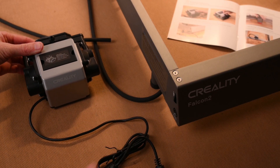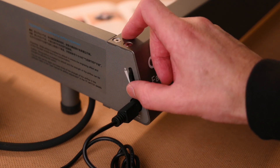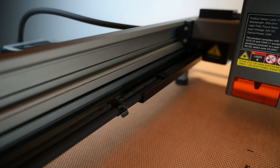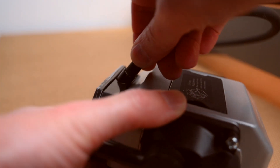The air pump can be placed next to the laser and a single cable plugs into the side of the frame for control and to receive the power. Just above the plug is a dial for manually adjusting the air flow. A low setting is used for engraving and a higher setting is used for cutting. Most of the cables and air hoses are already neatly managed into the frame, so we just need to plug in the laser module and connect the air hoses and then give the machine a quick check over.